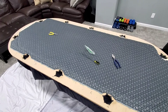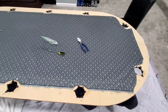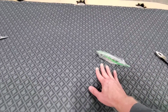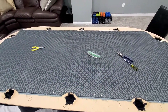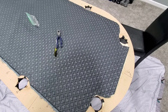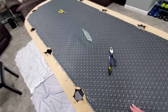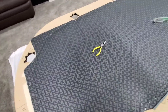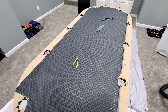The rail cover is off now — I pulled out all those staples. This is the last piece, this is the problem: the loose felt. As you can see, it's just too loose to play cards on — not as tight as it should be. So now basically the last step of fixing this thing. No need to pull staples out of one end — it just needs to be stretched lengthwise, that's where all the waves are. Got to pull all the staples out of both sides and one end, and then once those are out I'll just stretch it this direction, start putting in new staples, double check it, and it should tighten down pretty easy.